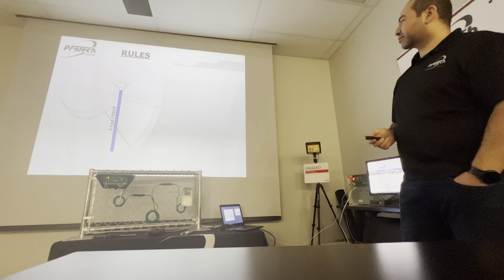The power supply has three options: 24 volt, 48 volt, and 12 volt. Maximum range is 328 feet or less. The system is operational during winter conditions down to minus 40°C and up to plus 70°C. There are three types of columns: receiver only, transmitter only, or both receiver and transmitter. Column heights range from 1.5 meters up to 3 meters. Cells range from 10 to 28 — with 28 cells it's 14 on each side in double configuration. A column set can be up to 10 pieces, single or double.